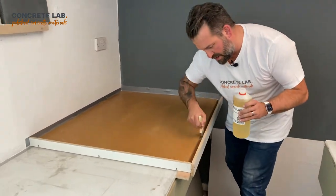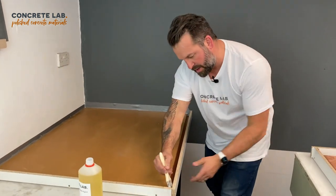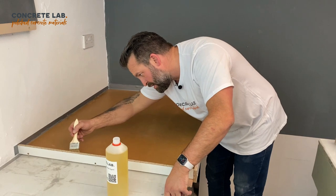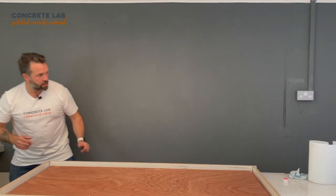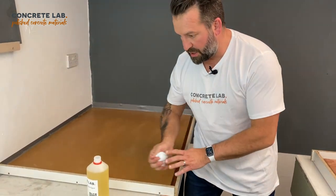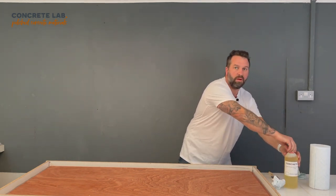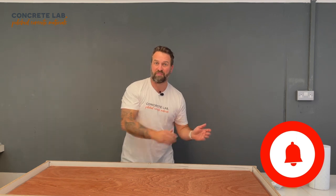Over to the worktop — we're going to do exactly the same. I've got lots of excess release agent on my brush so I don't really need to add it anymore. It's just going to go on the melamine and the base of the lip, and I'm just on this side going to put it in a bit more gently so that I don't get any release agent on the MDF substrate. Just grab some kitchen towel and give that a wipe out. And that's the priming and the release agent done — we're now ready to pour the concrete, which will come in the next video. If you are enjoying these videos, please hit the subscribe button below and click the little bell icon next to it so that when we upload another video you'll get a notification right away.